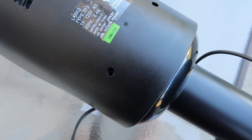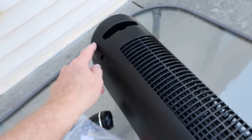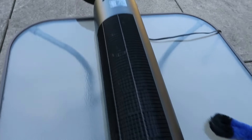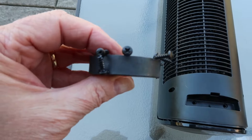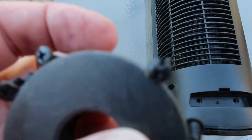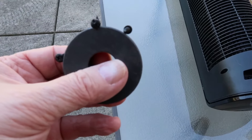As I said, it's kind of strange because there was a spanner screw in there and there's a Phillips head in there. So we're going to open up these four to start with, and then there's also two here by the handle. We remove two screws here, two screws here, and two there. Strangely enough, two of them were this strange spanner type — you can see that right here. I always keep things like that on a magnet so I can just stick it to the side of my table and those things aren't going to roll away.